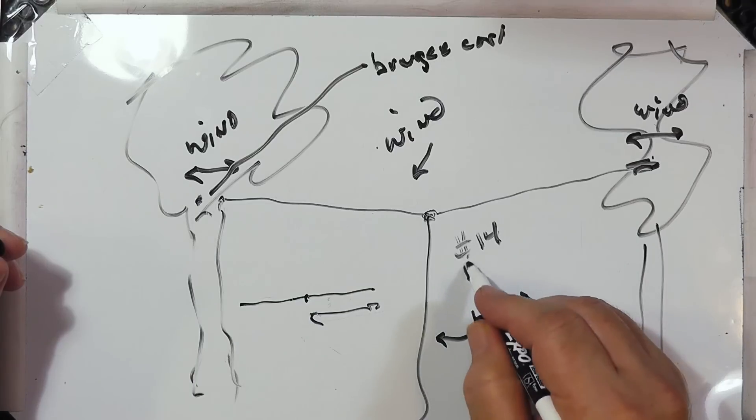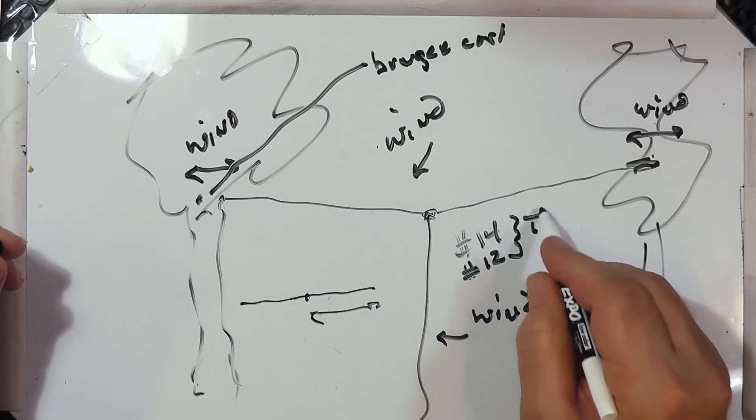What will happen is this antenna is going to move — nature is in motion all the time. When that thing moves, you're going to constantly be moving that wire. His concern is that if you take household wire — I would recommend insulated wire, like a number 14 or number 12 THHN, which is just normal house wire — it's soft copper, not hard copper. Hard copper has been pulled to make it strong, which also makes it a little more brittle. But the thing should not have so much stress on it that you're at the breaking point anyway.